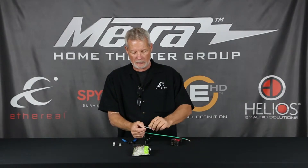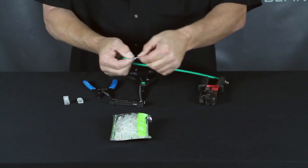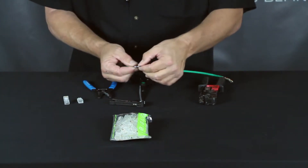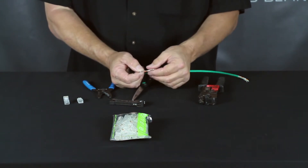The reason you're going to do this is because once you unwind all of your conductors, get them all spread out and the wrinkles worked out of them — and for that I recommend using your thumb and forefinger on your opposite hand to work out the wrinkles — then get your color code laid out: 568A or 568B.